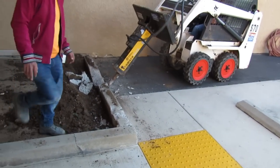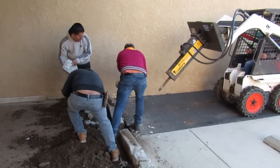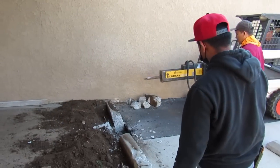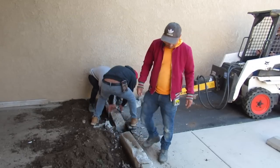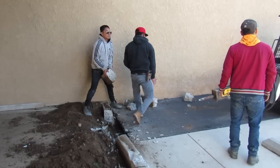Because the curb in the back against the wall is staying. We're just concreting it level with the existing concrete by that truncated dome right there. And the asphalt right behind these guys right there, I make it even with the concrete. So I take that piece out too. I didn't originally notice that or agree with it. But when I was here, I was like, it'll just look better. And I'm getting a yard extra of concrete anyway, so why not? So I'll just make the whole thing.